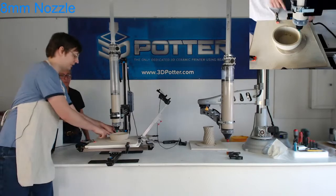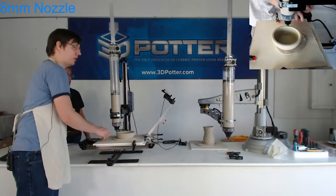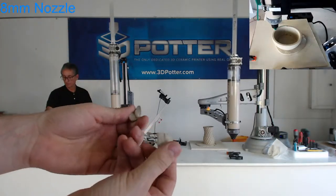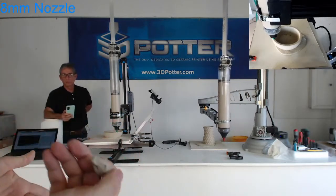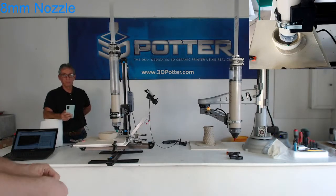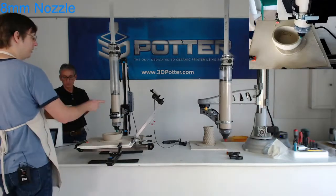Yeah, this is not slip. Let me just try and not ruin the whole piece. Thank you. So, no, this is not slip. This is full body clay. Water content is comparable to bag clay. We add just a little bit. So a prepared bag of clay, we add 15 ounces of water or even less. And then that goes straight in the tube. Okay.